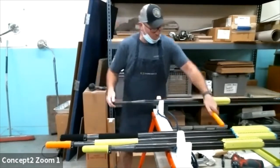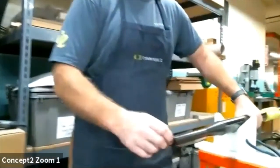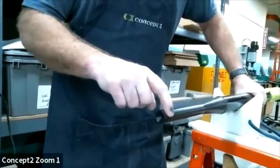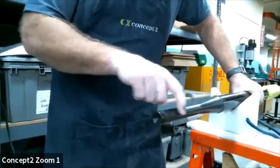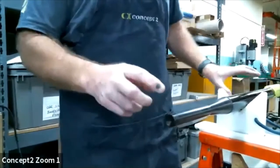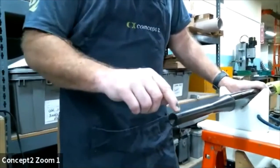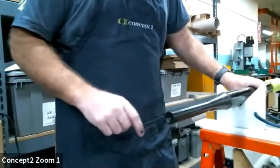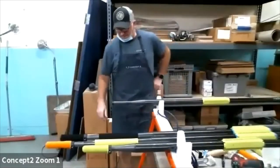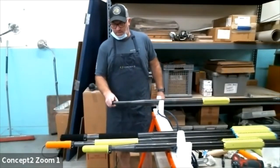If you look at the M-plug, it is oriented on the handle with a keyway. There's a keyway here that's a raised area. This is really important when you're going to take off the M-plug — you want to make sure that M-plug keyway lines up with the keyway of the handle right here. It's super important you get those things lined up. So when you remove the M-plug and bond in a new one, you've got to make sure it's lined up exactly with that inner keyway. To remove it, I'm going to heat it up.